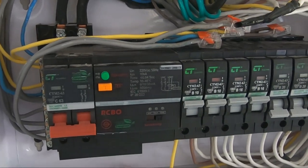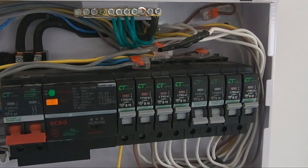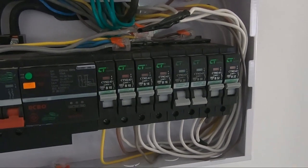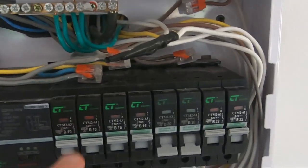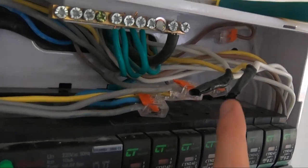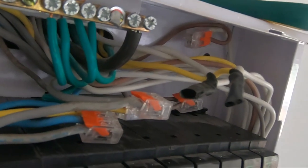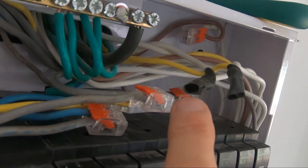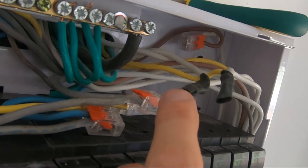Wow, I've actually discovered there are 7 twist and tape joints in this box, which is, well, there's only eight breakers. So that means they just didn't leave enough wire sticking out at all for any of the circuits. A bit disappointing, but it is what it is. I've just stopped here to show you these two taped joints. You see, it's the same as the one that was behind the socket that I did earlier. No doubt they were squashed down together, so they were closed, but it's only been, you know, 2 months or so since they've been put in, and the ends opened up, so, you know, that's totally vulnerable to something getting in there,